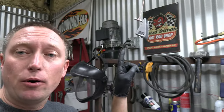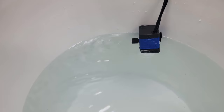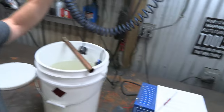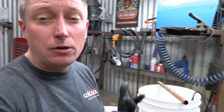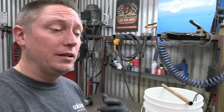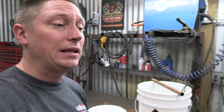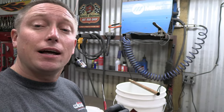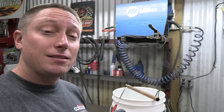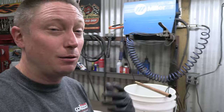Now it's time to get our freshly cleaned part into our electrolyte solution. You're going to want a small aquarium pump inside the electrolyte solution to keep the water churning. I recommend a 50-gallon-per-hour unit — anything bigger circulates the water too strongly and it's not good. I'll put a link in the description to those pumps; they're on Amazon and eBay for about ten bucks. I do recommend having a spare ready in case one goes out while you're plating, because the zinc plating process really likes to lock up the impellers and motors on those pumps. I'll sometimes take a dental pick, stick it inside the motor, and turn the impeller to get the pump going again — which does make them last a little longer.